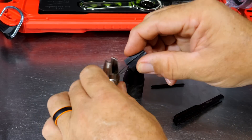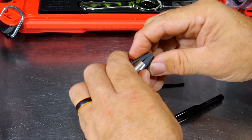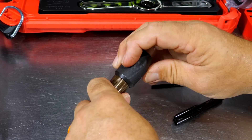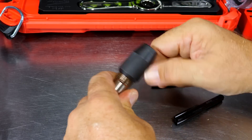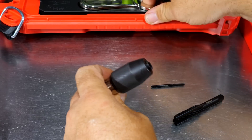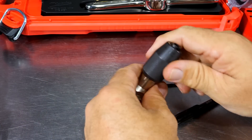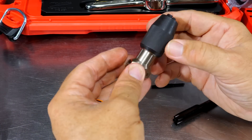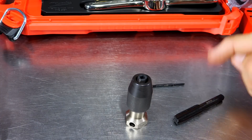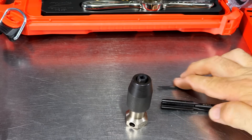You have one tool doing the same job. As things wear out, you can replace the jaws or get a new Hex Lock tool holder, or replace the T-handle if needed. Even the T-handle is serviceable, as you can see with these plates. It's a really cool design that takes out of the equation the question of which tool you need to hold which tap.